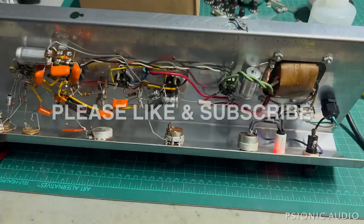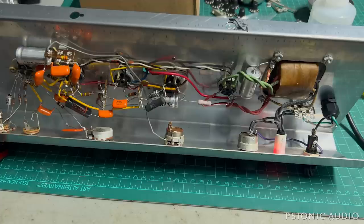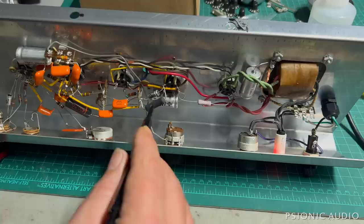That puts the bias at about 16.5 watts versus 16.1 watts, so a little bit warmer, nothing much. None of the voltages moved that much. So it's now exactly the stock amp — it's just that this resistor is not going to drift like an old carbon comp can.